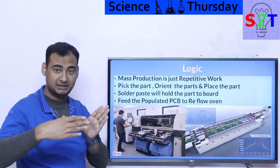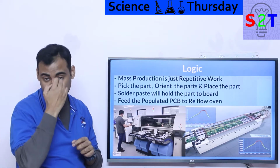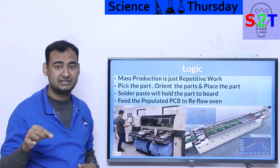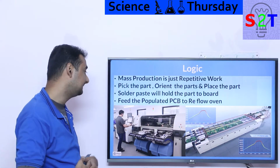Once you have laid down all the components, placed every single component on the PCB, you have to be extra gentle with that equipment. Now again, big components don't care that much, but small ball grid arrays or fine pitch equipment, that is a really delicate operation. You have to be very mindful with that.